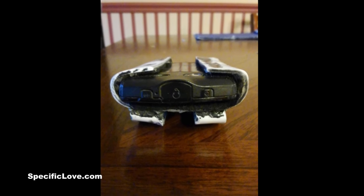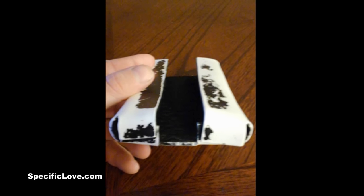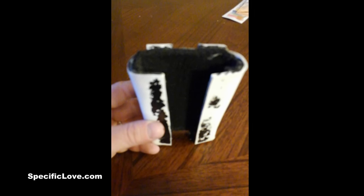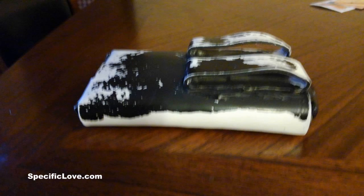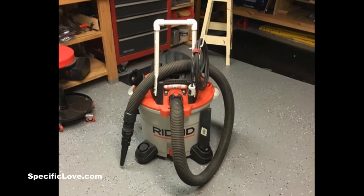Next up is this cell phone holder, also by Cody Atkins — he's very talented with PVC pipe. He used four-inch schedule 20, cut down one side, heated it, and then flattened it out. He made some marks and then reheated it and bent it again. He also lined it with fleece, then cut three-quarter inch wide straps for the belt loops. That's very cool, Cody.